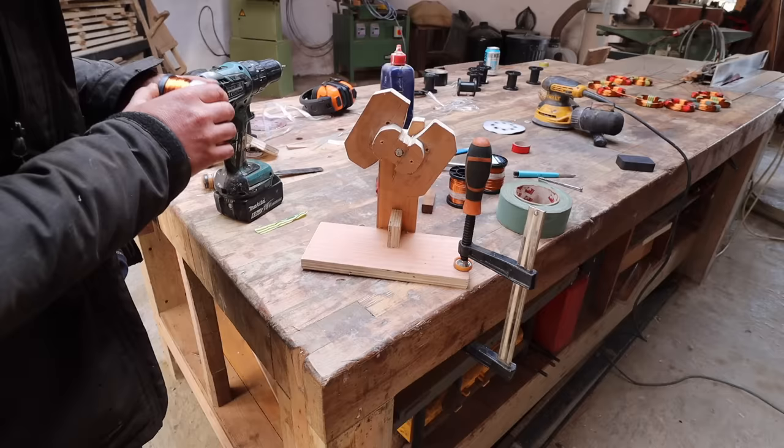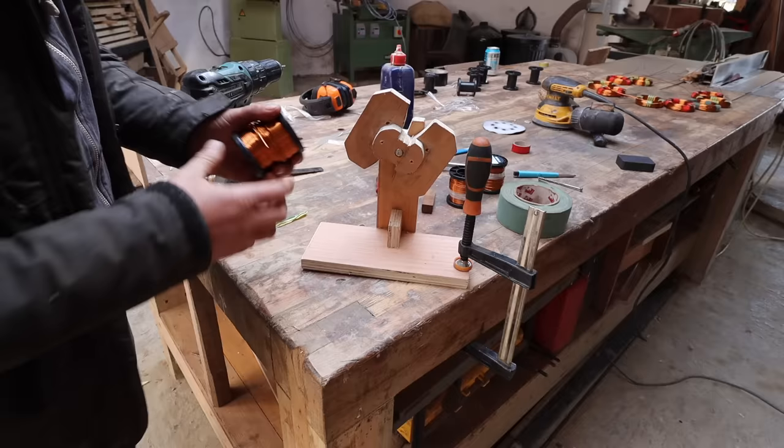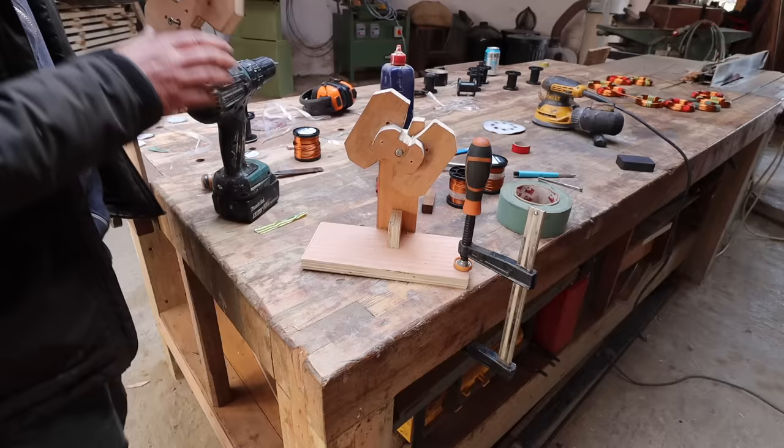Some winding coils. So I made this little coil winder, it's just out of plywood. So this wind turbine is going to be quite big, and it's got 12 coils of 150 turns of wire. And it's also chunky wire, I can't remember the exact size, I worked all that out a while ago. Yeah, basically it's going to be a monster.